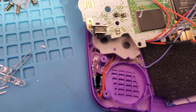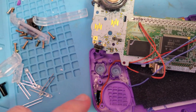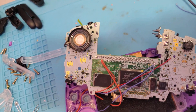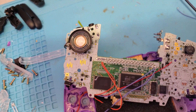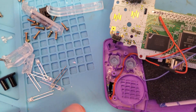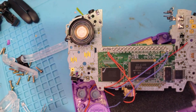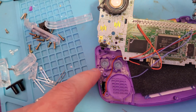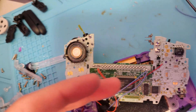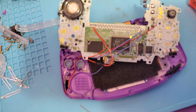I got these ones glued in. As you can see from earlier, it's pretty tight in there, but it is glued in. I routed a few of the wires through that little area there and they're coming up here. I put them both directly onto there — it was easier because otherwise I'd have to tape up a bunch of stuff. A difference between this and the Game Boy Color is I put the resistors on this side of the LED — on the front face side instead of the back — because there's enough room in here.